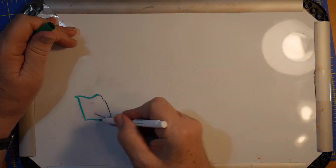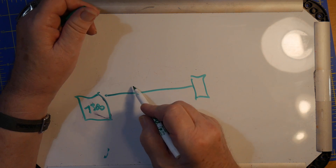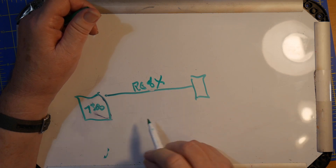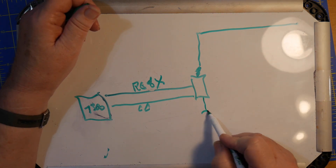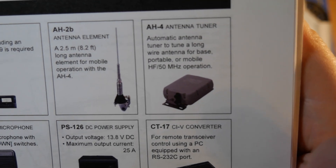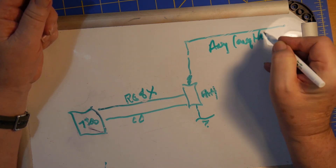Let's take a look at what this is. He has a radio, the ICOM 7300, and there is a tuner out here outside. You have the RG8X and control cables here. From here you attach a wire to wherever you want. And ideally this is grounded. This is the AH4 right there — that's the AH4 antenna tuner. It's a weatherized unit designed to work outside. This wire, any length, and this will tune it.